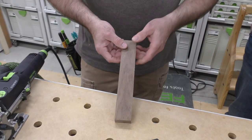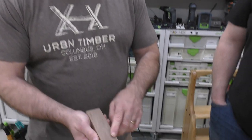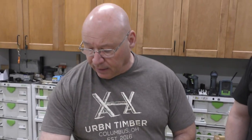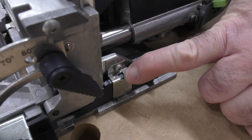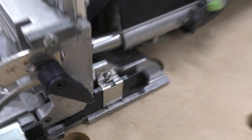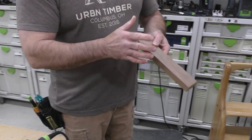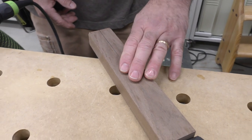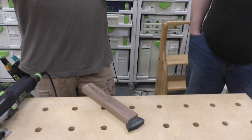Say we had 50 of these — always mark the face where you want to reference the plate. This is 25 millimeters thick, so I set my plate height for the thickness right here. That way I'm at or near the center where I want to be. The reason I say always mark your spindles is that if you don't mark the face, you'll have a tendency to do a mortise here and a mortise here from different sides, and if it's not exactly in the center you'll have a problem — we call that helicoptering.